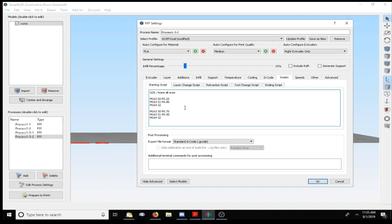You're just going to have to print anything, you know, test cubes or anything. You can use the LCD controls on your printer to vary that mix while it's printing. So say you did a tall test cube or something like that. You could sit there and adjust that mix as you go and write down the numbers, what color you think looks the best, and then use that for your virtual tools later. Okay, so we've set extruder 0 for 70, extruder 1 for 30, and set this as virtual tool 3.